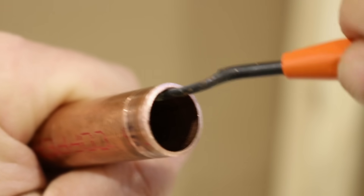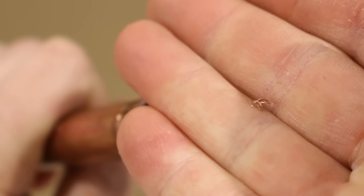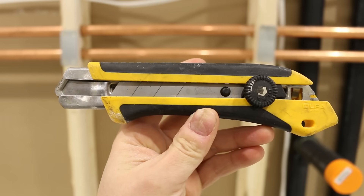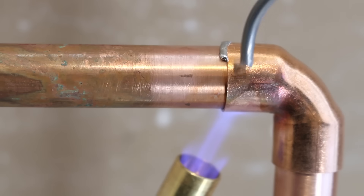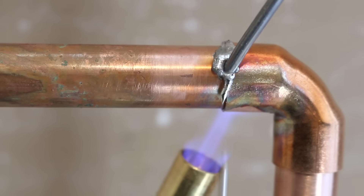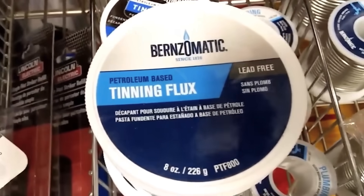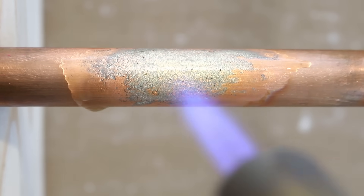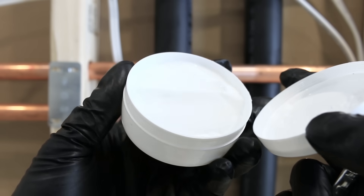When working with copper pipe, you absolutely need to deburr the inside of the pipe after it's been cut. For this, you'll either need an all-in-one tool, a pencil reamer, or just a simple utility knife. You'll also be needing some soldering paste or flux. Soldering without flux is basically impossible — it's what keeps your pipe and fitting from oxidizing when being heated. There are several types: normal flux and tinning flux. If it's your first time soldering, I suggest using tinning flux, as it pre-tins your joint with a lead-free powder and reduces the chances of a leak. Make sure to get a lead-free and water-soluble flux.